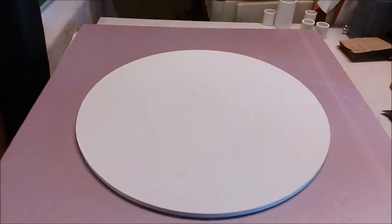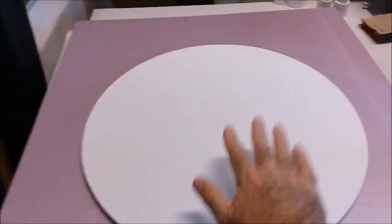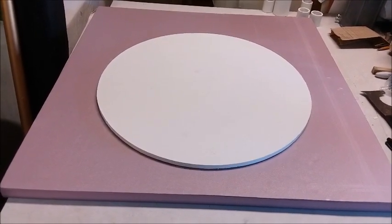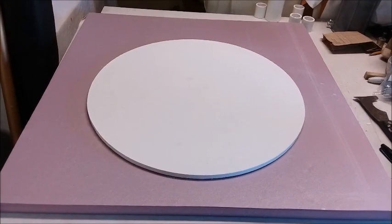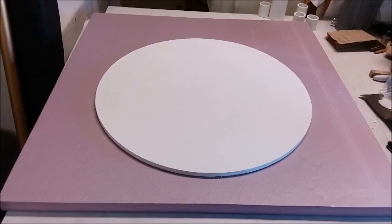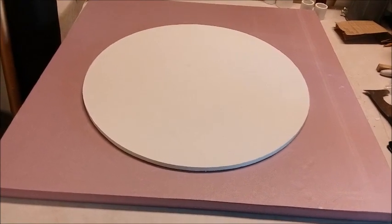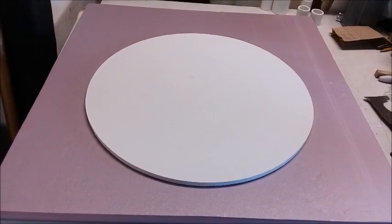I've set the slumping mold on another piece of pink foam. I had it on newspaper, but I don't want the newspaper to suck the moisture out of the plaster too quickly — that could cause it to warp. Plaster this thin doesn't have a lot of strength, and if it dries too quickly it can warp. I don't want to introduce more astigmatism into the blank than it's already going to have. So I put it on the foam and I'll let it sit and dry for a few more days. I may hit it with 400 sandpaper to take off some of the remaining texture, but I'll have to wait until it's dry — otherwise it'll just clog up the sandpaper. Then it'll go into the kiln.